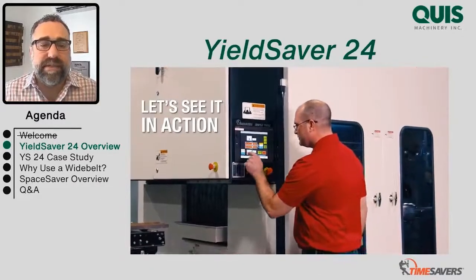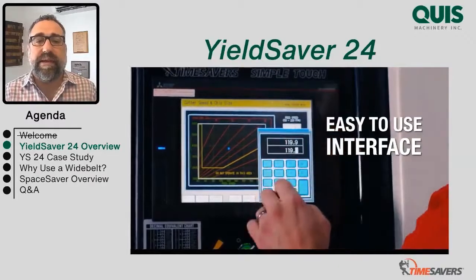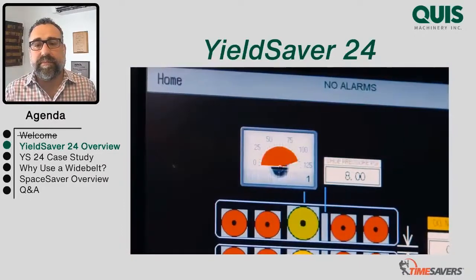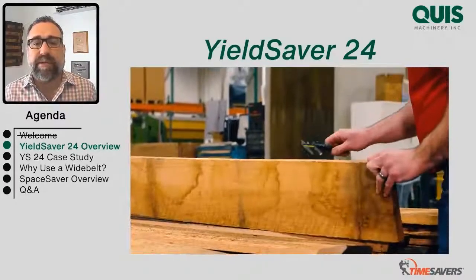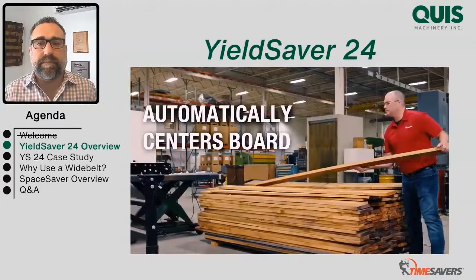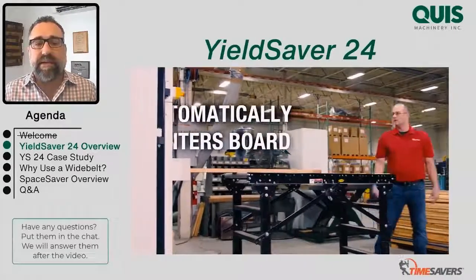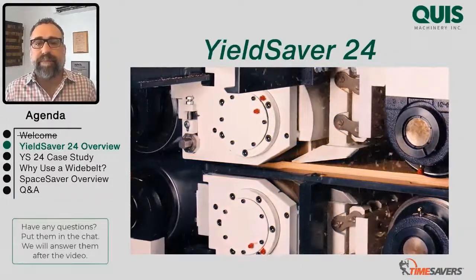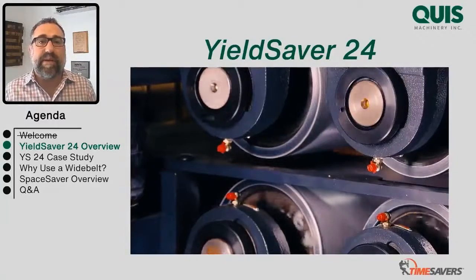So what we're going to do is see this in action. We've slowed this video down to about half speed so that you can really get a view of what's happening. Here he's obviously inputting the dimension that he wants. He's checking the machine. Is it prepared? Is it ready to go? It's up and running. All right, I'm measuring my wood to make sure I'm going to be able to get enough out of it. It's going to feed it through, and again, that floating head's going to automatically center. The boards are going to kind of center themselves. And what we're going to end up with is somewhere around, versus your traditional planers, 3 to even 8% better yield out of the wood.